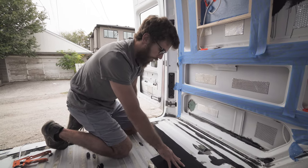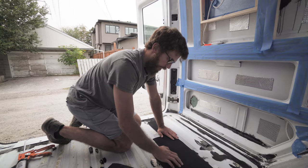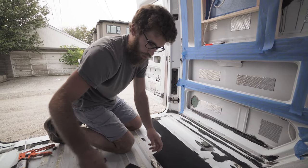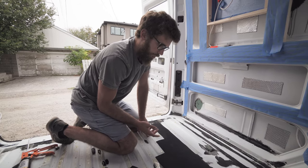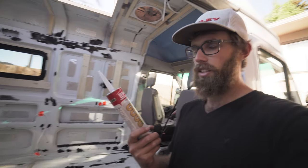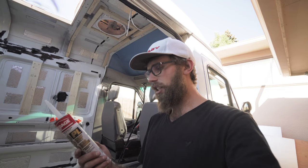We're using some thin rubber to fill in some of the larger gaps between the ribs, just for a little more support for the insulation. This is just some rubber material I had laying around, but you can use anything that's a quarter inch thick — even quarter inch thick insulation from the hardware store. This is the construction adhesive I'm using to glue down both the insulation and the plywood — it's PL 9000 heavy-duty extra strength. It's all-weather and remains flexible, so it should work pretty well.